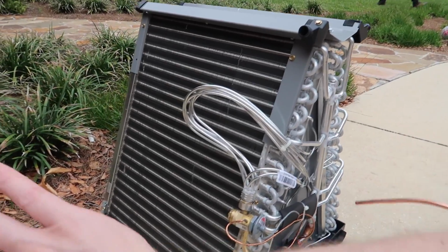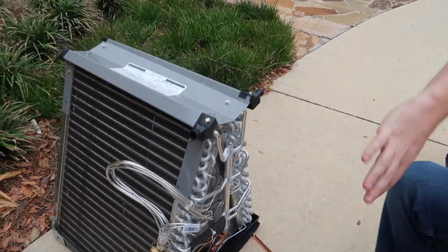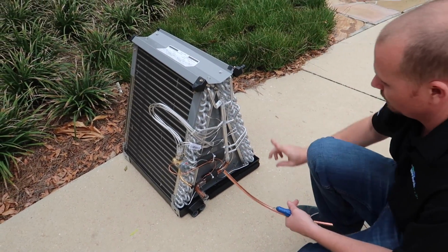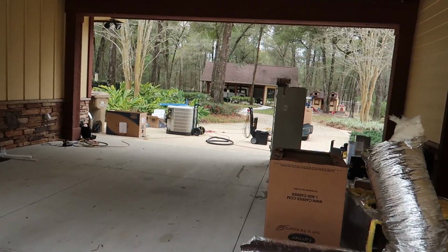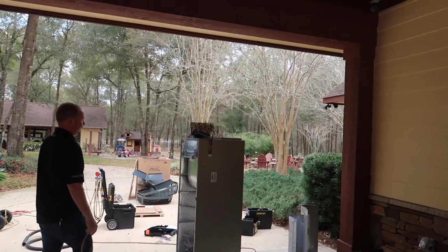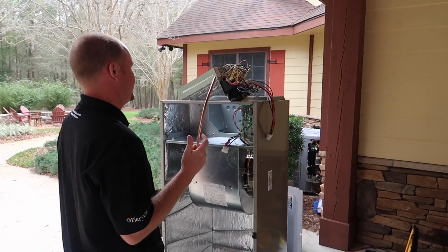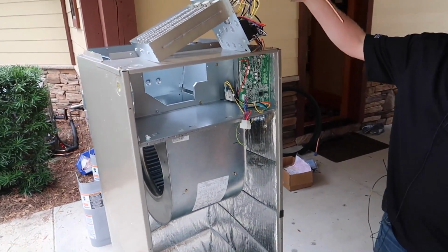And so that fan just blows air off of here? It actually blows, in this particular case everything's going to be upside down, but it's blowing this direction. So it blows in the opening and then out. Okay. Yeah. This is your air handler. Obviously it's downflow, so everything's going to be flipped in this particular case. But this is your heat strip kit. This is a unique heat strip kit. We've got the highest end heat strip kit. It's 3 stages.